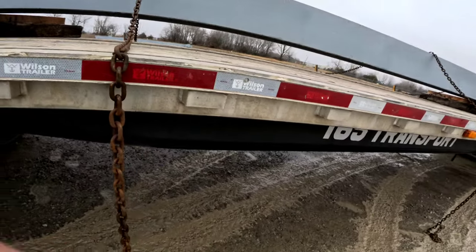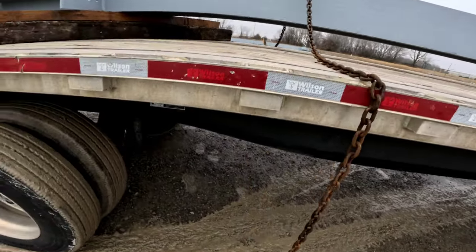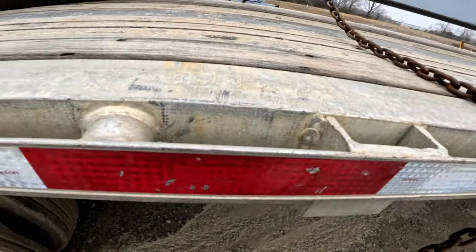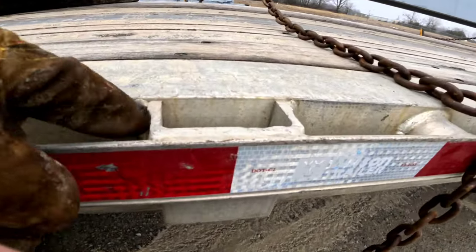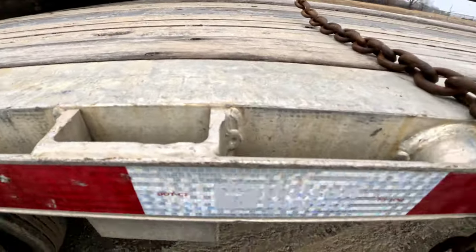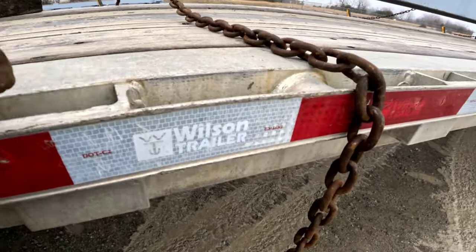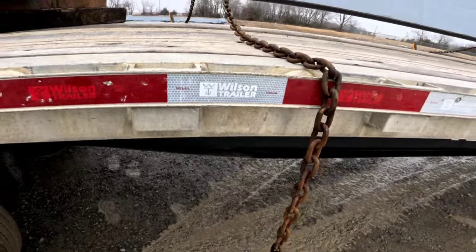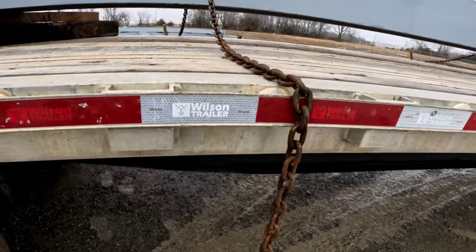Okay, cool. That's me. So you see the weld points? The weld goes all the way around the spool. There's no weak point. These welds, you only got one on there, but this is a weak point. No weld there. No weld there. That's a weak point. This could easily be pushed in, whatever. Nah. So I'm going to go around the spools.